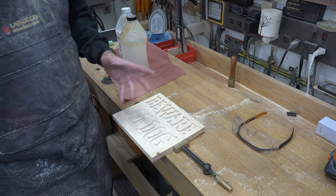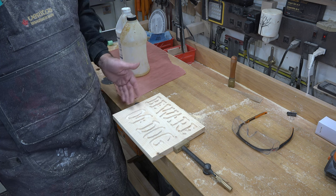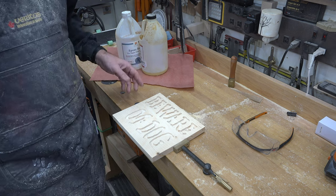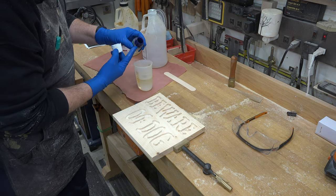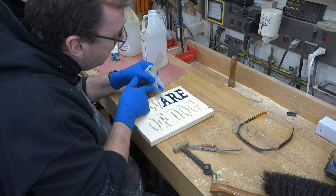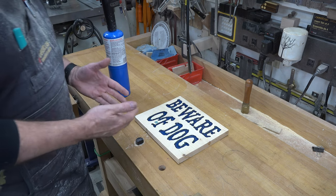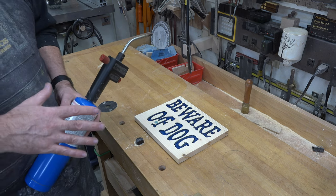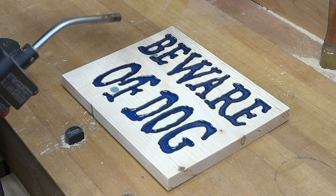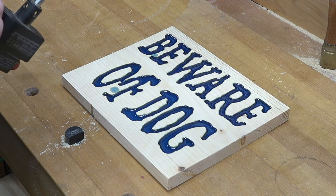Truth be told, my original plan was to paint inside these letters just like I did with my old signs. However, that quarter-inch routing was a little ambitious — it's too deep to get in there and do a good job painting. So I have some old resin that has yellowed; I've been looking for a project to use it up. I'll mix it up, dye it blue, and pour it into the cavities of the letters — I don't need to fill them completely, just make them pronounced. If your epoxy forms bubbles, you can remove them with a propane torch. The CO2 gases expelled from the torch will pop the bubbles.